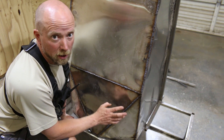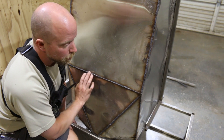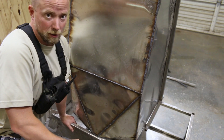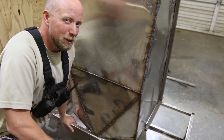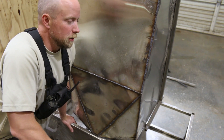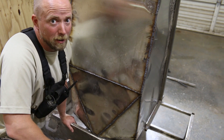So what I ended up having to do is spot welds using the Lincoln Electric in MIG mode, spot welded everything in and then went back through and spot welded it again. I've basically done a double weld — spot welded on the outside and then started welding on the inside. Because the metal is so thin, it is really, really darn hard. But I'm still pretty proud of myself. A pro welder is going to look at this and cringe, and I kind of do too. But still, I did it. I didn't know how to do it when I first started. The fact that it's together and that it's going to hold water is a pretty big deal.